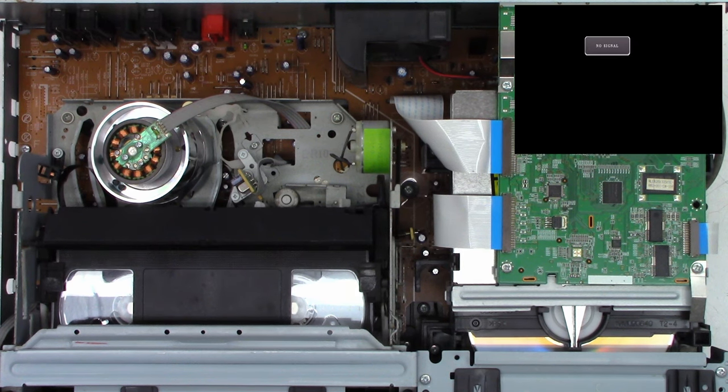Checking the pad, no conduction, and 0.06 on a 1000. I'm perfectly fine with that. Check the pad again, nothing, and the capacitor reads 0.14 on a 470. I'm okay with that. This is going to be a 1000 at 6.3, and it reads 0.1, just ever so slightly high in my book, but I think I'm going to let it slide.